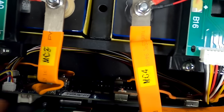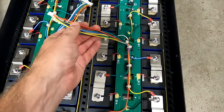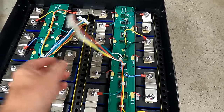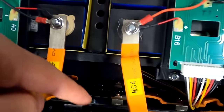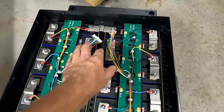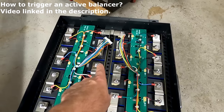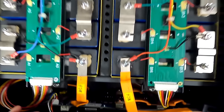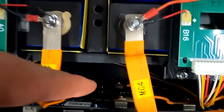The version one of the Seplos BMS has only a 120–150 milliamp passive balancer, which was not enough to balance the whole battery pack. So I installed the wiring harness for an active balancer. This active balancer balanced the whole battery within half an hour or 45 minutes, while the other one took the whole night and didn't do much. I left the harness in because we'll need this again — the passive balancer of the PCB is just not enough for this battery.